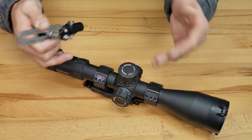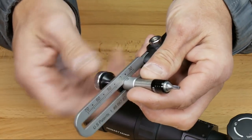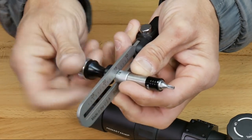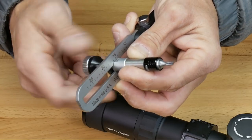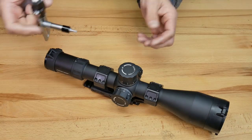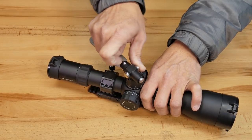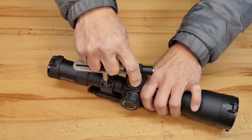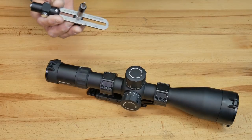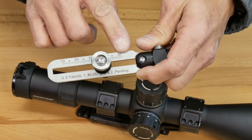For demonstration purposes, the recommended 16 inch pounds on the cap screws — now I need to go to the low side, which is on the other side of the scale. I'm going to find my 16. There's 15 — I'll get this started, go right to 16, my quarter turn. Once I'm there, I'm ready to start tightening. On the lower end of the scale I always pre-torque just a little bit. There it is — that's 16. Always remember to chase everything, but that's how simple it is to go from that 10 to 27 inch pound scale to the high end, which is 28 to 70.